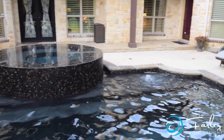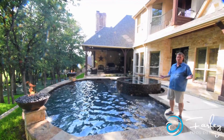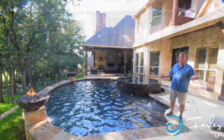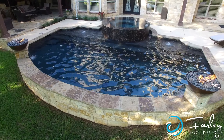In certain areas we couldn't do that, so we came in with planting pockets to kind of cover that up so we didn't see raw foundation over time. Everything around the pool was level until we got to the back side of the pool, where we're sticking out of the ground anywhere from two to four feet. Four feet was a bit much, so we actually came over the retaining wall across the back of the pool to terrace it — the back of the pool has a drop beam as well as a retaining wall to balance that elevation change.